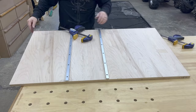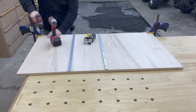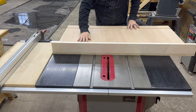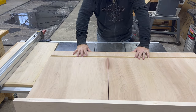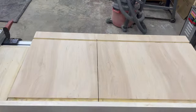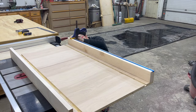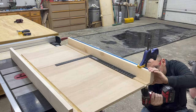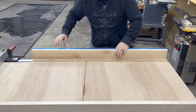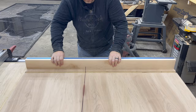I'll attach a piece of 1x4 maple to the far end of the crosscut sled — the side that's away from me as I'm using it. Then back over the table saw, I'll make a cut through the plywood, stopping just short of the near side. Then I'll attach the fence to the near side with just a couple of screws from underneath, using a framing square to get as close to square as possible, and then we'll show you how to dial it in. I'll make the cut all the way through, being careful to keep hands out of the way since the guard isn't in place yet.